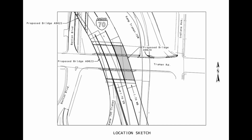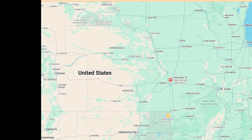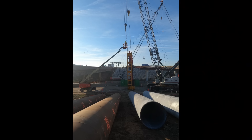This is the location of this particular bridge project — I-70 and Truman Road near downtown Kansas City. What's interesting about this project is that it involves four-foot diameter pipe pile, seven-eighths inch wall thickness in the upper section, and three-quarter inch wall thickness in the lower section. These piles were originally configured to be closed-ended with a cruciform driving tip. The large diameter pipe piles at the intermediate bents, bents two and three, have a required capacity of 1,725 kips — a kip is a thousand pounds. The planned length of these piles on the intermediate bents is around 110 feet, and the upper sections are galvanized for corrosion protection.